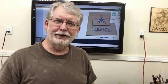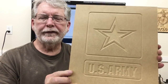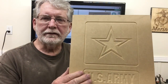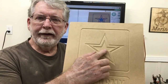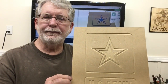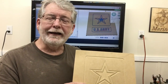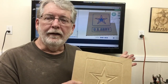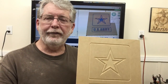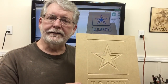In just 15 minutes versus 45 minutes I was able to carve the Army logo and it looks great — this was at 160 inches per minute and my machine has never ever gone that fast. It's still rock solid and looks great. I could have done two-stage carving with a flat bit but I wanted to see what results I'd get at these kinds of speeds using a V-bit, and it is fantastic. If you're trying to make money with the X-Carve you really need to modify it with the CNC for Newbies Z-axis — that one upgrade alone cut the time from over 45 minutes down to 15 minutes, doing this at 160 inches per minute in one pass instead of multiple passes.